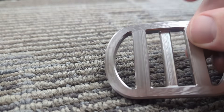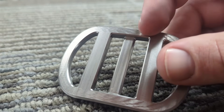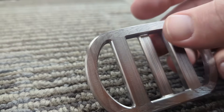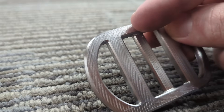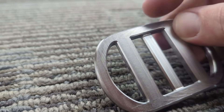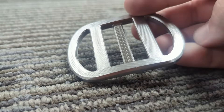The front I did do the crosshatch. You can see something interesting with the way the light plays off right here — there's kind of like waves. I think that was actually a smoothing issue with the machine. There are different smoothing modes you can turn on, and I had it set to a roughing mode, and it tessellated on the part a little bit. It could also have been in CAM. You can see a mismatch of tenths or less, and some of that tessellation pattern going across the top. That's something I could optimize for later.